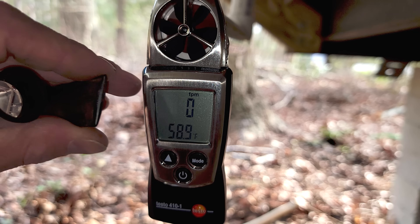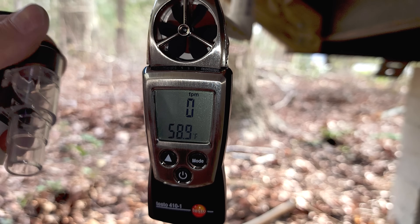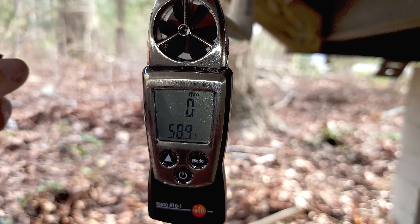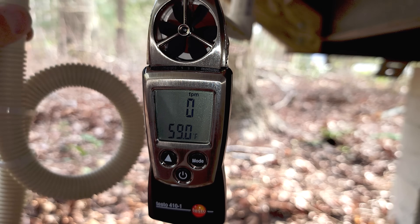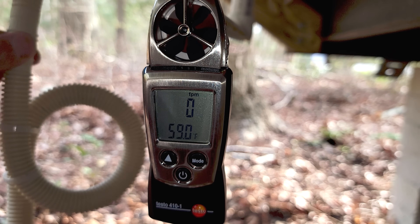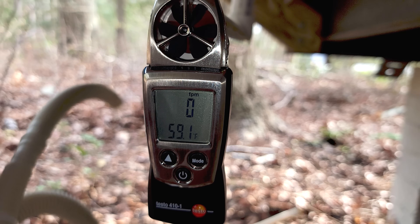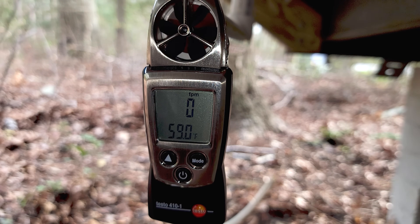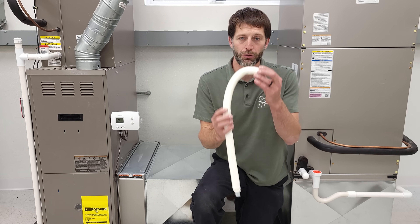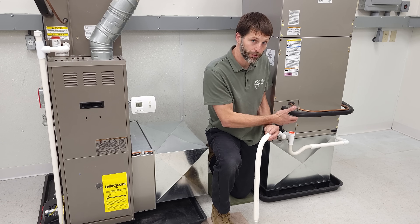If you're concerned about bugs, you could put on a dry trap or something similar. But you're asking for trouble anytime you add anything onto the system, especially a large water trap, which will end up clogging over time. You don't need a trap on a wall-mounted ductless unit — just make sure wherever the condensate is dripping is in a safe location. A mini-split condensate line doesn't need a trap because it doesn't deal with the static pressure that a ducted system would.